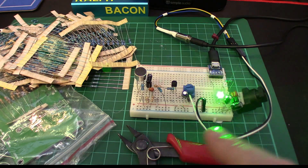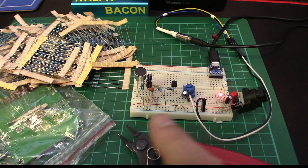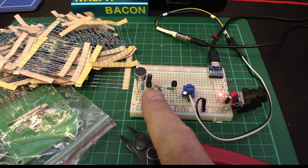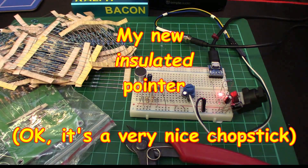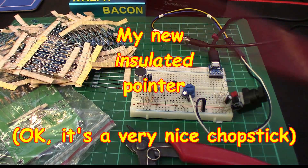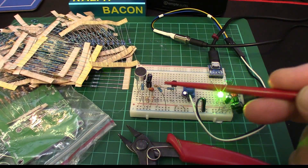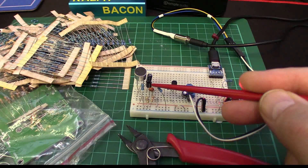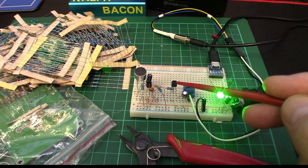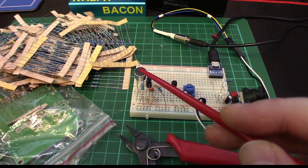This unit here is a better amplifier than the one I showed you before — it's a two-stage amplifier. You've got one transistor there and one there. We have a BC548 transistor here and another one here, with some negative feedback going on.